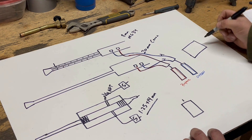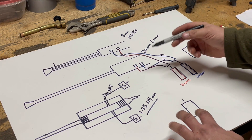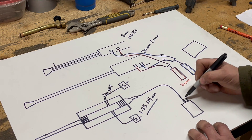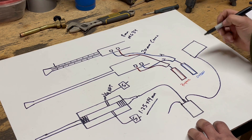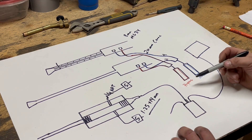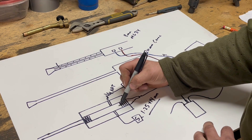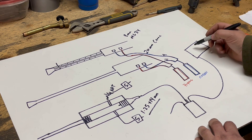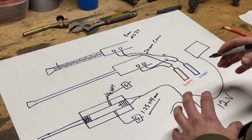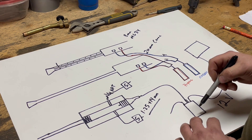To make this work, there's going to be a circuit control board that controls the pulse to open and close the solenoids and make the spark plug fire. There's also going to be an ignition coil powering the spark plug, also controlled through the circuit board. The other part of the system is fairly straightforward - the ignition coil gives power to the spark plug to make the spark in the chamber. This is going to be a 12 volt system, able to run off either a battery or the 12 volt battery in the vehicle itself.